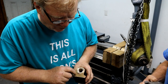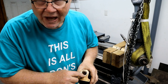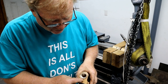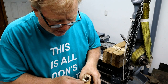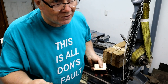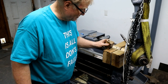That's easy. What I'm going to do to make this thing foolproof and stay in is drill the intersection of the nut and that sleeve, tap it, and put either a screw or a set screw into it, with Loctite. That'll be half in this, and it'll keep it from twisting. It will also be threaded, so it will keep it from coming out. And we do one on the other side. If this ever breaks, well, no, it's time to go see Jesus, because all hell's going to be breaking loose.